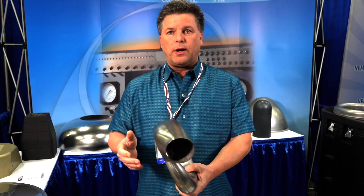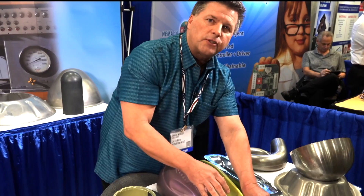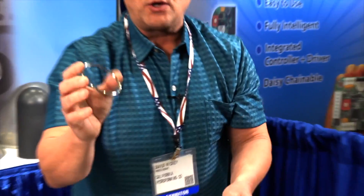These here go into AP units and they're stainless steel 300 series, different configurations. We have a hula hoop shape — it starts out as a flat surface that becomes a can, and then we do trimming and put in a bulge die, and the bulge die gives you the final shape. They're tight tolerance — about two thousandths on diameters that we have to maintain.